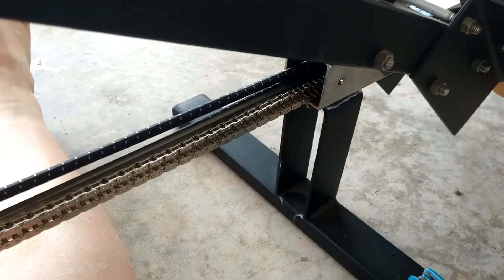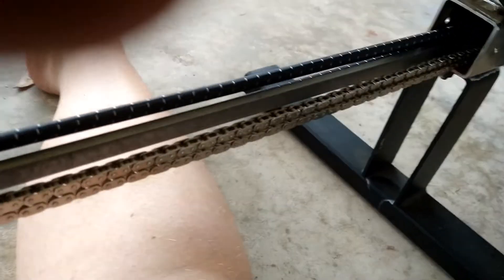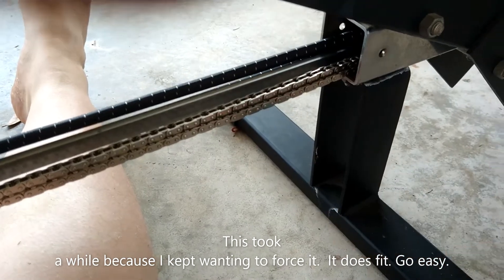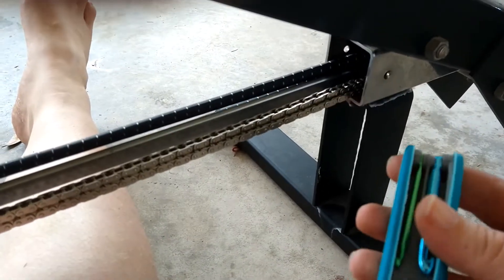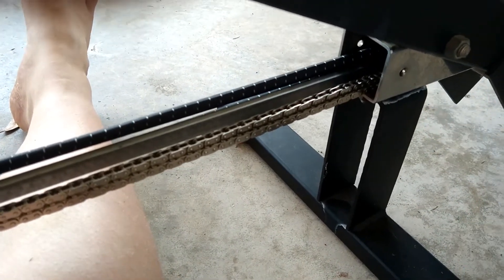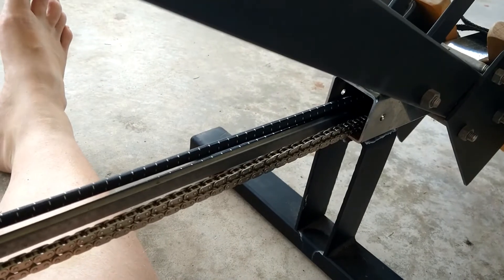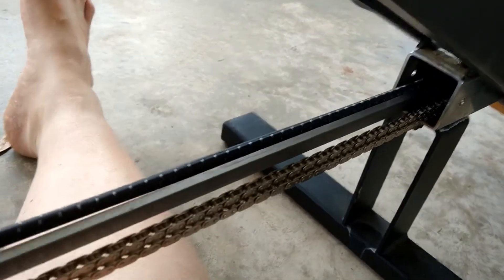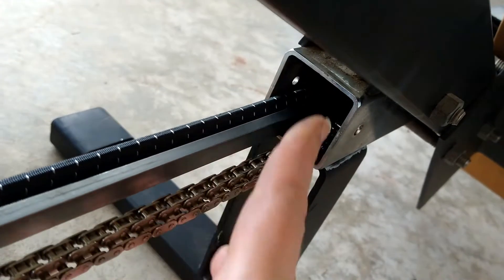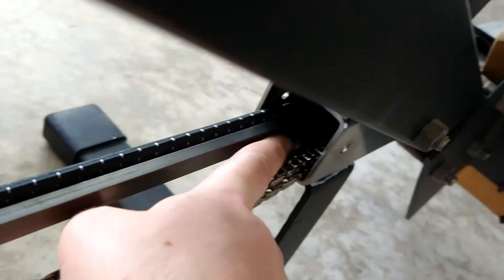I'm in the process of sliding the new skewer assembly inside the monorail. This was finicky because the traveling pulley has a bolt out the side of it that holds the sprocket inside the thing, and it kept getting caught. So I used my crochet hook, put it in just enough there that it wouldn't get caught, and then the skewer assembly slid in just fine. As with everything else in life, if you have to force it, it's probably not the way it ought to be — slide it out and slide it back in. Also, there's a ridge, and as you slide it in, you need to make sure that both sets of the skewer assembly are appropriately sorted across the ridge, or it will get stuck right there as you start. Keep that in mind.